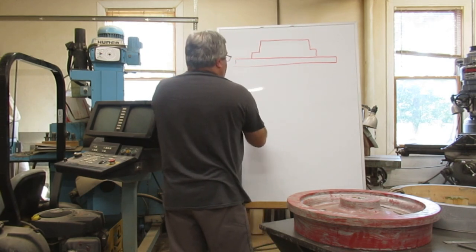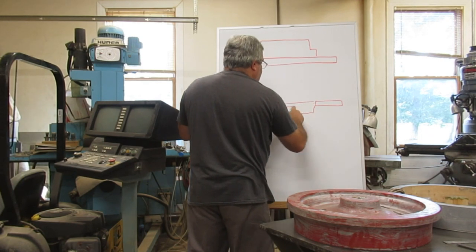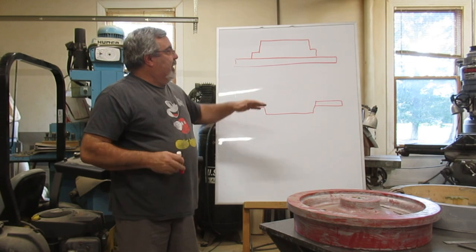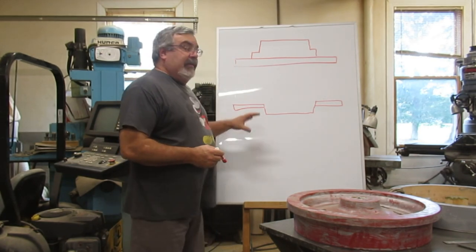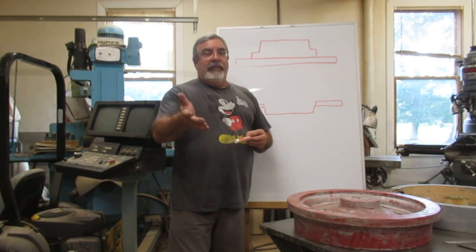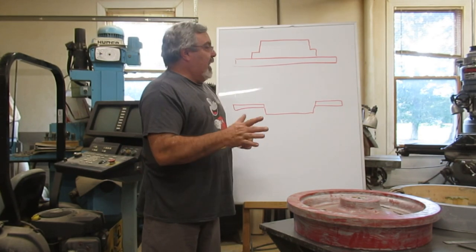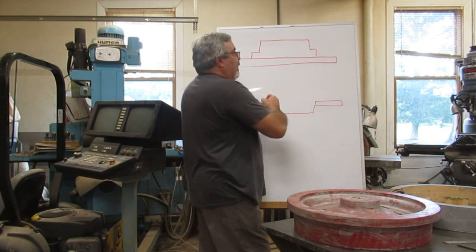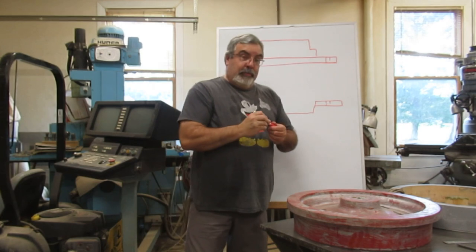For cope and drag boards, one part goes on one board and the other half goes on the other — it's going to be an indent. That's what your cope and drag boards look like: here's your drag half, there's your cope half, or vice versa depending on what the foundry wants. I usually make my cope and drag boards out of one-inch plywood — it's kind of hard to find, but Freeman Manufacturing has it. I'll have my editor put links in the description.